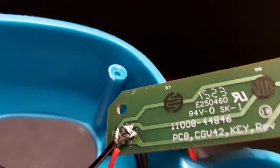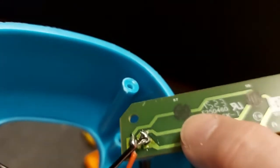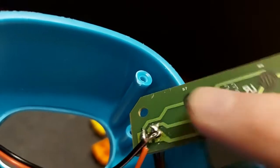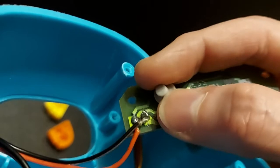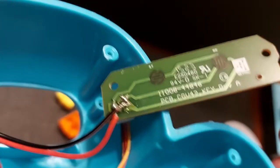What I've seen some people doing is soldering right to the edges of this little switch — putting a dot of solder on one side and a dot on the other side. The problem with that is that you can't use the switch anymore, because the little plungers on the bottom of the switches will no longer activate it. That's personally the way I prefer to avoid.